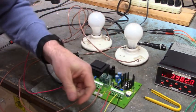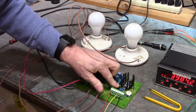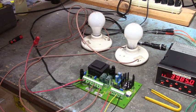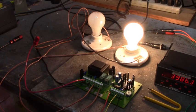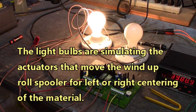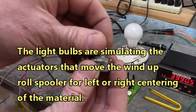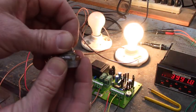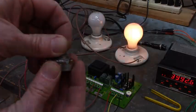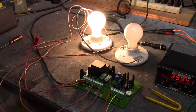I'm going to put a new one in there and we'll see what happens. Let's try it now — get plugged back into the wall. Look at that. Let's go back the other way. There we go. Oh, nice. I'm turning the pot so that we have a positive or negative voltage on terminal 14 there. Nice — we fixed another one.